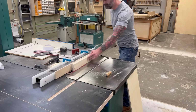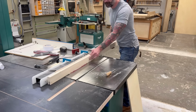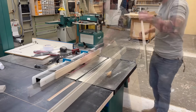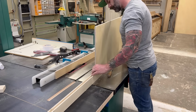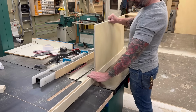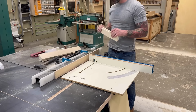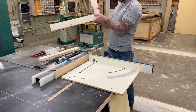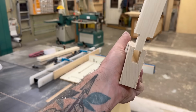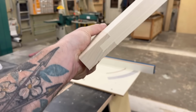After getting it milled, I ripped it all down to the correct widths, and then I started adding a nice dadoed groove on the bottom of each piece so that I could float a 1/2 inch sheet of plywood as my center panel. After getting my groove all situated in my 4 frame pieces, I did a little tester to cut my tenons and make sure those would fit nice and tight. Something like this. Basically, I'm making a giant shaker style door.